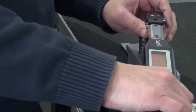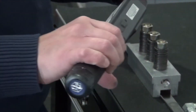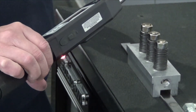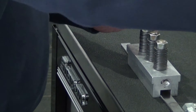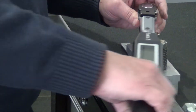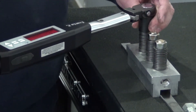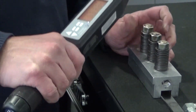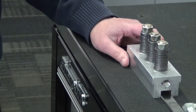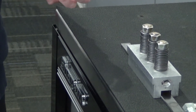And let's just say by accident I try to re-tighten it. It's going to tell me there was no turn and you reached torque — which indicates that you're trying to tighten the same fastener twice. Now here's the example where you really can't tell that the condition of the joint has changed by looking at it. But as I apply torque to this, I haven't reached my target and I have too much angle, which is indicating to me that at least in a hydraulic fitting application, I haven't sealed the fitting.